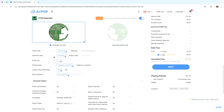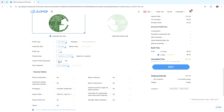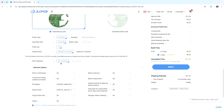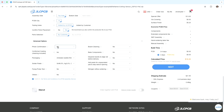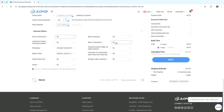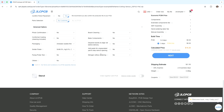Let's keep it at economic. Assemble side: top side. PCBA quantity: 10. Tooling holes — they need to add some, I don't care. Confirm parts placement — a JLCPCB engineer will correct parts placement and polarity, which is not too bad. Part selection by customer. No photo confirmation needed. No conformal coating, no board cleaning, no baking components, no depaneling, no paste for unpopulated pads, no nitrogen reflow soldering. I don't need a stencil — they will use one internally.